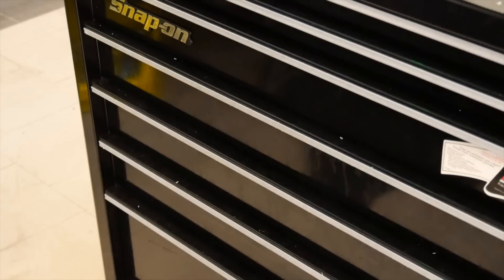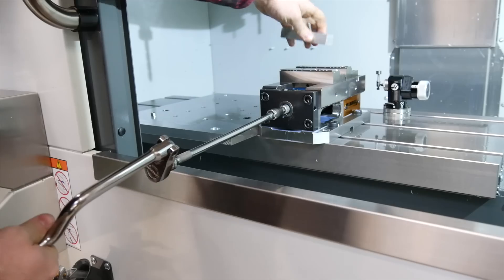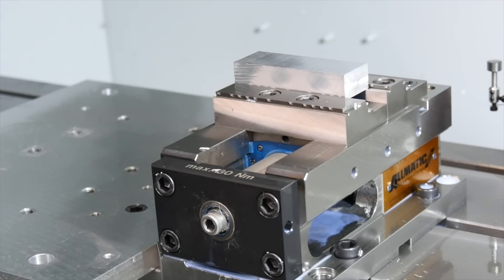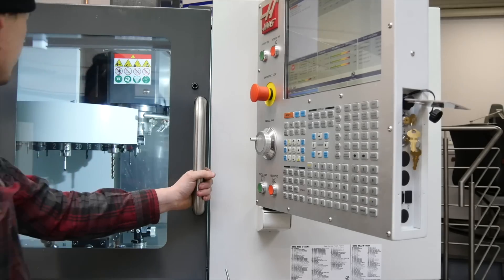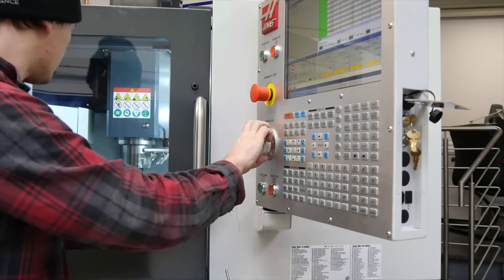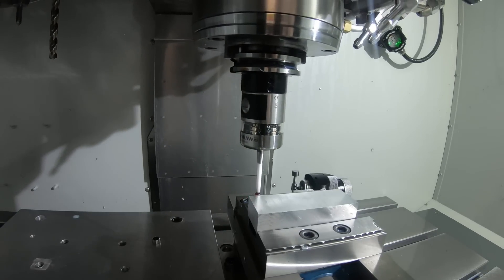The first step we do is to mill the inserts. It is very important that the part we want to mill is correctly fixed in the CNC - for this we use a special vise. This vise can clamp the part with a lot of newton meters. Then I change the tool. I use the Renishaw probing head for checking the work offset. This probing system is pretty good and works fine.